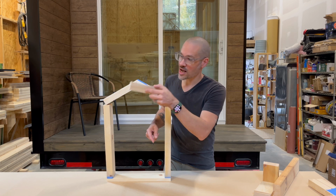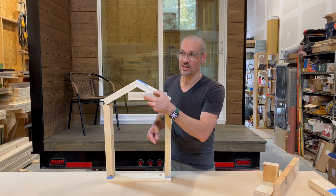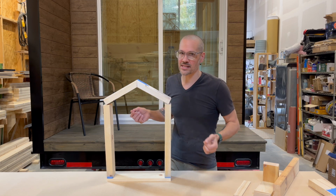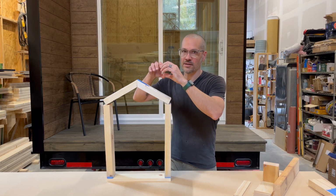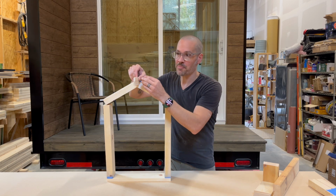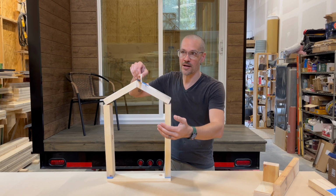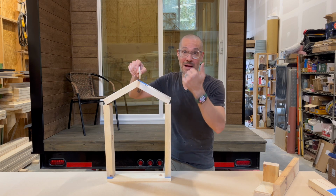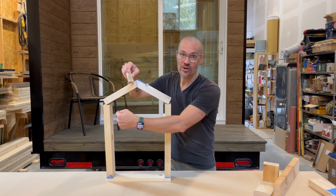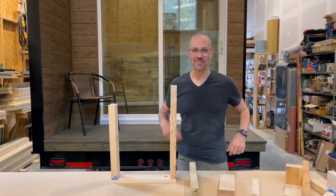So you can do collar ties. It is possible. It has to be on every single rafter. And so, to my eye, it doesn't make a lot of sense. I'd rather put a ridge beam in that is capable of going at least 6 to 8 feet or so, and then using a combination of bathroom wall, bedroom wall, and sort of like that barn feel of the big beam with a half post.